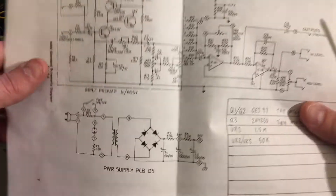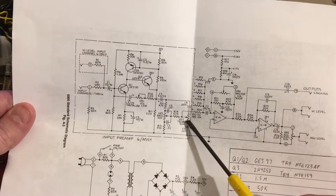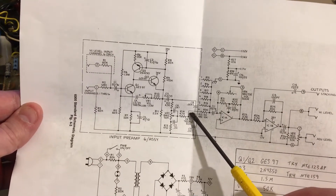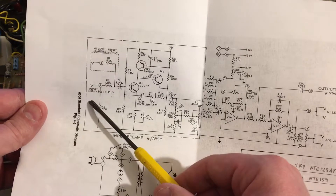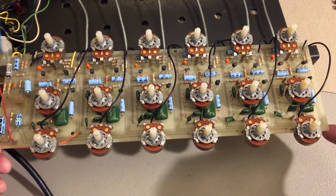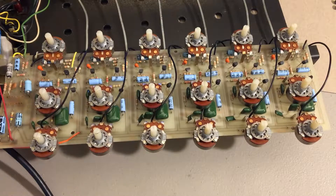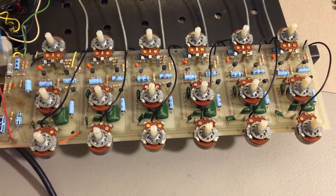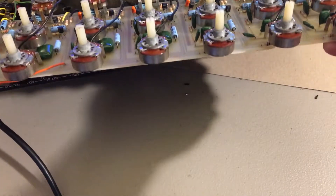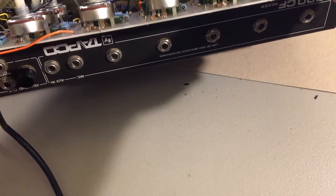As mentioned in the schematic, those resistors are no longer in the circuit. The signal gets to the treble pot and then goes out to the outputs, which were once the unbalanced inputs. Everything over in the master section does nothing now — just power supply and such. There is an auxiliary input that should still work and get you to the master section.